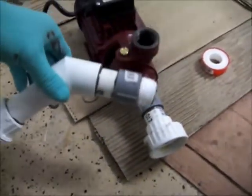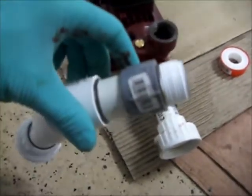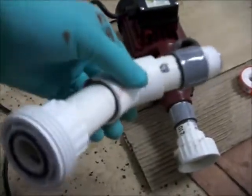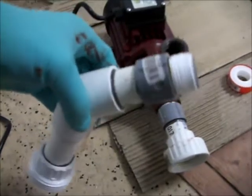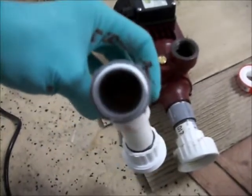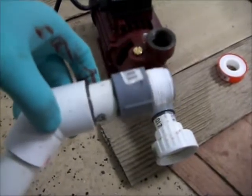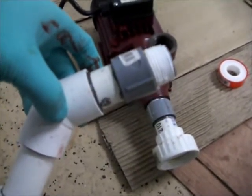Wiped it all off, so I just got tons of Teflon tape on there now and we'll see how that goes. I thought maybe it was these grey PVC fittings, because apparently the grey fittings don't last nearly as long as the white ones when you're dealing with caustic and methanol and whatnot. But the grey fittings are actually in really good shape still — it looks like it was just the sealer I used in the threaded fittings.